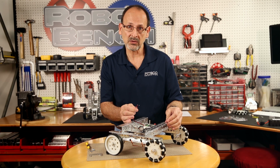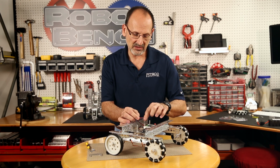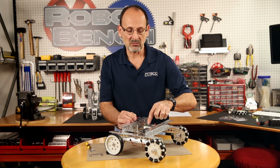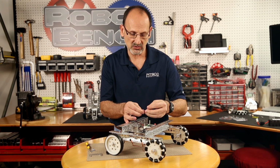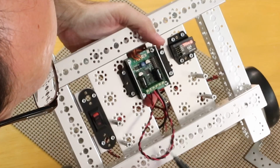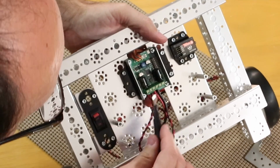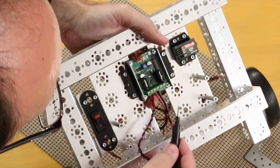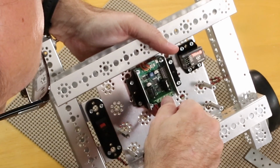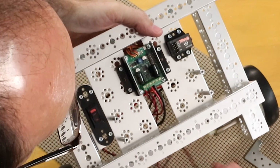You can actually reverse the direction of the motors by changing the direction of these wires, but it's also kind of easy for you to keep in mind if you maintain a little bit of the consistency the way you've already created. So for me, I usually do positive on the left, negative on the right. So I'm going to go ahead and fasten the left side of my left motor, and again I'm making sure that I've got my red on the left, my black on the right, kind of like I do for my power. I'm going to tighten those down with my 4-in-1 screwdriver. Once I have that done, I can go ahead and attach my right side motor, sticking this up through.